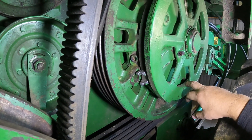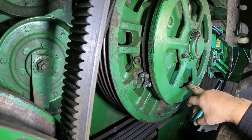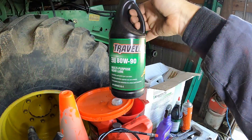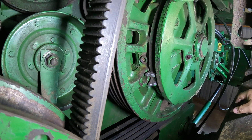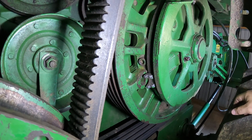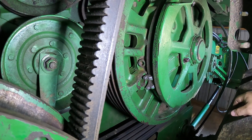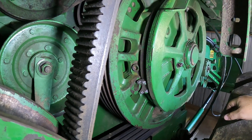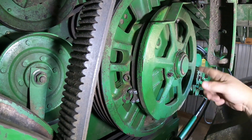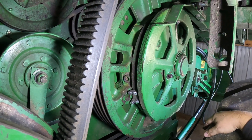It's really thick, slimy, gooey, sticky oil — it's an 80W-90. Typically your oil for your car is in the 30-40 weight range; this is in the 80-90 weight range, so that gives you an idea how thick that gear oil is. But it's in there for these gears, and since we're in reduced speed we're using those gears a lot.